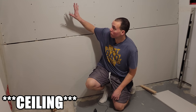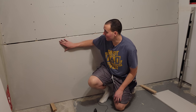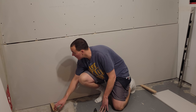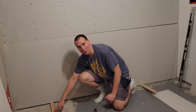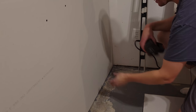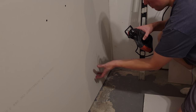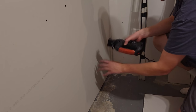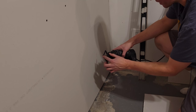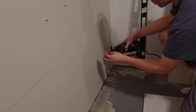I've put up the ceiling first, then the top section, and now the bottom section. We want about a half inch of gap between the floor and the bottom of the drywall. To help get the seam really tight, I've got two thin pieces of wood with a dowel at the end to get leverage and push it up nice and tight when I screw in the drywall screws. With the top few rows of screws holding the drywall in place, I've got my marking for the center of the electrical boxes. I don't want to attach screws at the bottom yet as that'll crack the drywall, so just a few to hold it up, then plunge in with a flush trim bit that has a bearing on the bottom to ride the inside of the box, trace the outside, and snap the cutout into place.